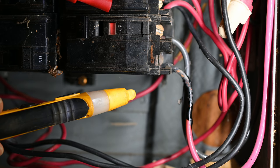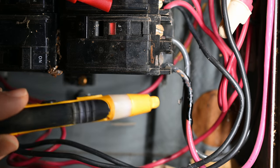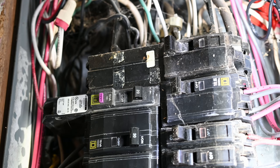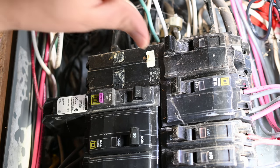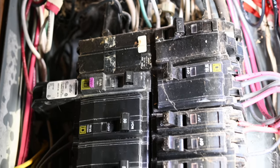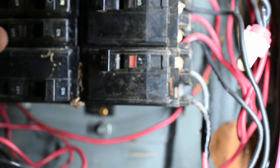What we're going to do now is turn the power off to the entire panel and take this breaker out. We're actually not going to loosen the connection — we just want to see if that connection was actually loose. Our main breaker is this one right here. This is a pretty old panel, but same concepts still apply. The power is off now. Technically you could get away without turning the power off, but turning it off is just an extra level of safety. Also wearing gloves is a good idea, which I am not for some reason.